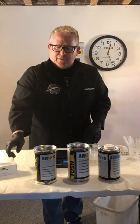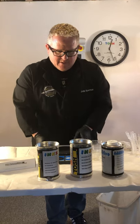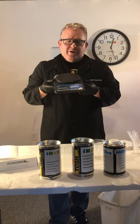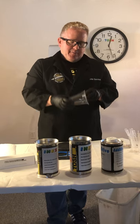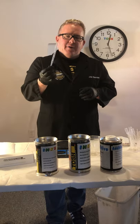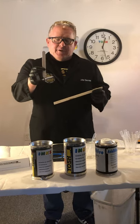This is a two-component ink, meaning that it has a hardener added, so hardener's in here. And then we have thinner. You have a scale that you need so you can measure the amount you're putting in by weight. A plastic PET mixing cup that won't melt when we put thinner in there. A disposable plastic pipette for adding thinner, and a couple of stir sticks — big stir stick, small stir stick.